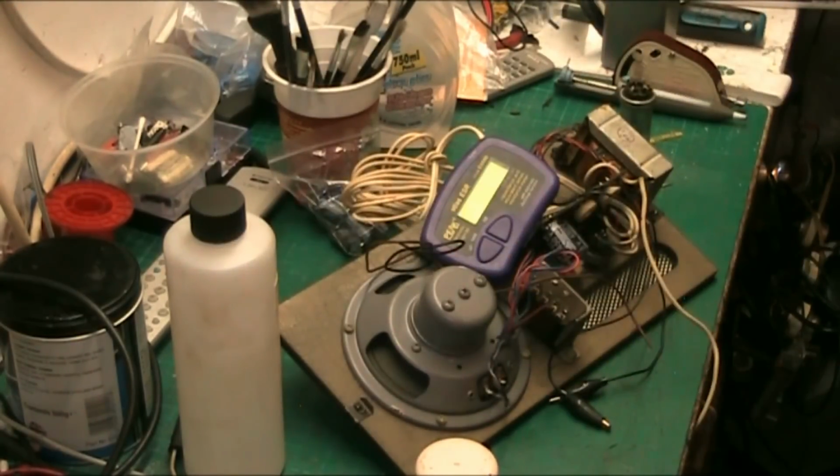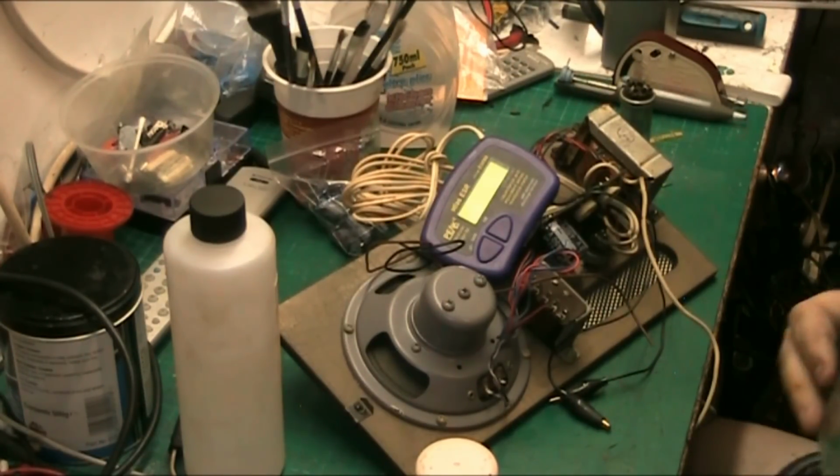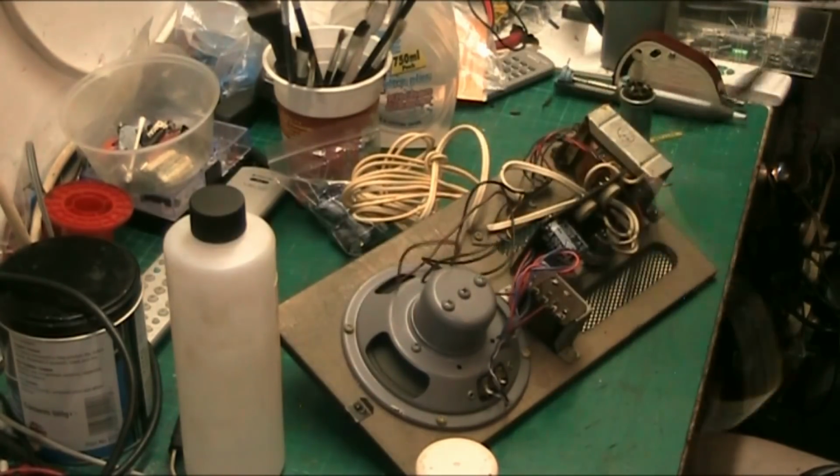Right, so if I put my rather large derriere back on the chair, now let's find a capacitor suitable. 47 at 200 volts, that's too much. You'd only put anything that big in it. 63 volts at 47 UF, and put that one in it, that'll be okay. That'll last the record player.